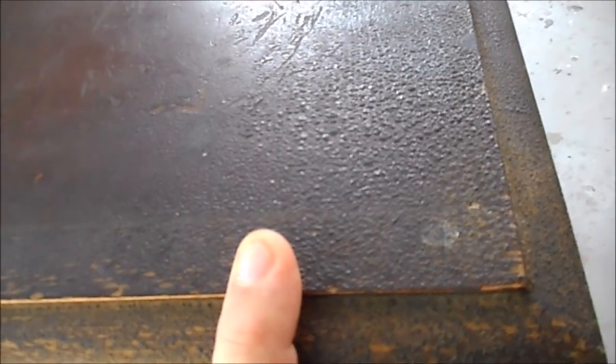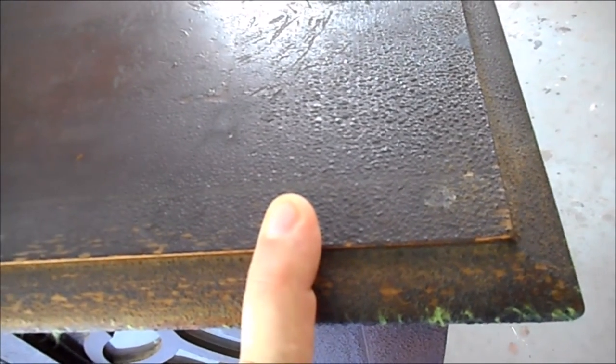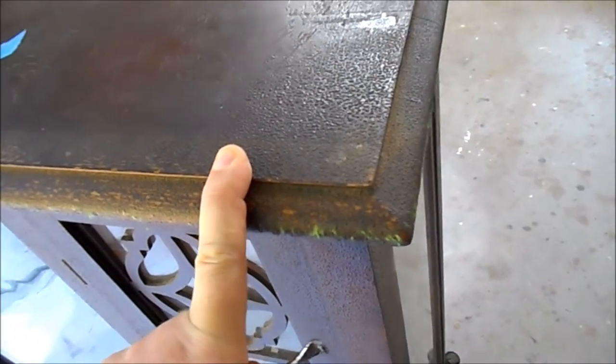Generally, you can date furniture by lacquer. When you have a lacquer finish versus a shellac finish, the number to remember is 1920. None of this stuff is exact, but it gives you an idea. And then if we come around back and you look at the panel construction on the rear, again, it's all age appropriate and it looks to be correct. If you focus in on these trim pieces here, right there, that's a wire nail.